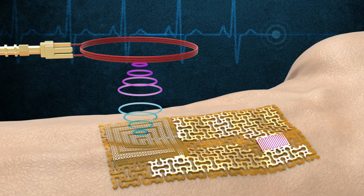The researchers found they could harness gallium nitride's two-way piezoelectric properties, using the material simultaneously for both sensing and wireless communication. They produced pure, single-crystalline samples of gallium nitride, paired with a conducting layer of gold to boost any incoming or outgoing electrical signal. The device was sensitive enough to vibrate in response to a person's heartbeat as well as the salt in their sweat, and the material's vibrations generated an electrical signal that could be read by a nearby receiver.